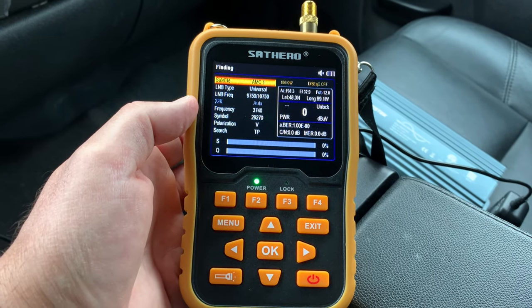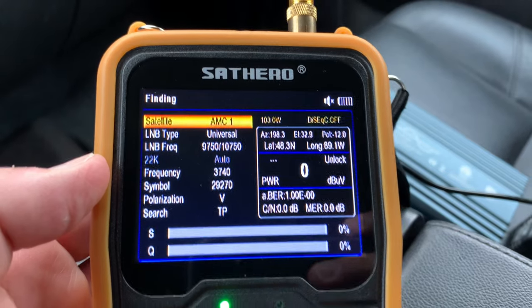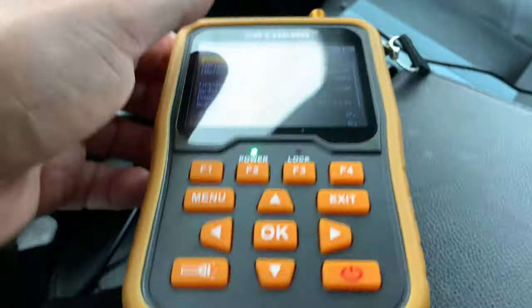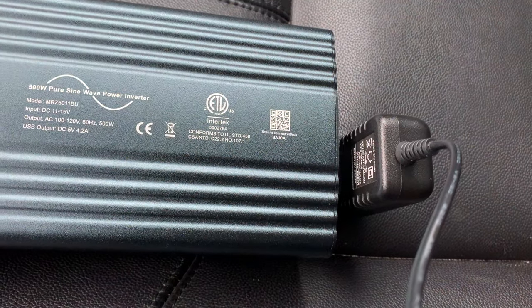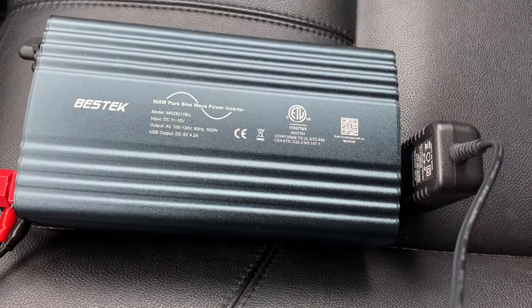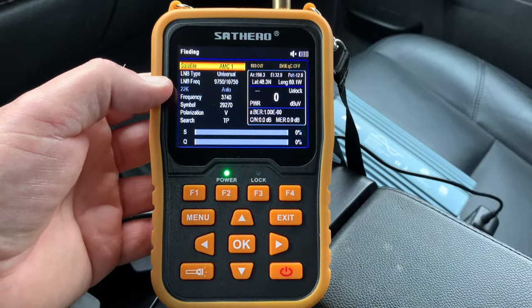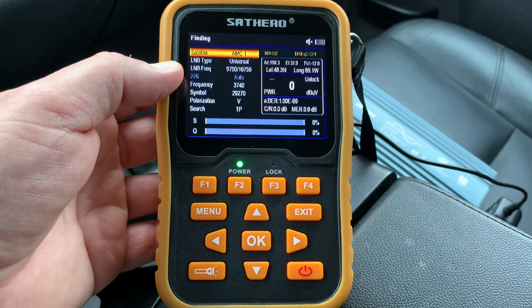Here's another example of a portable satellite meter — this is an all-in-one unit with a receiver and TV in a handheld size. This one is made by SatHero — the SatHero 400. I don't have it connected to a dish right now, which is why the meter reads zero. This one has a battery inside but charges off an AC outlet only — I don't have a 12-volt plug for this. So this is where the pure sine wave inverter comes in handy for charging devices like this that you don't have a 12-volt plug for. I just plug the charging cable into my inverter, and the inverter gets plugged into the 12-volt socket on the dash, keeping the battery charged. To watch satellite TV off-grid with this, just connect a satellite dish and run a blind scan, and it should be good to go.